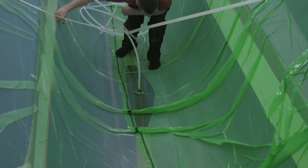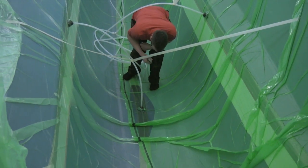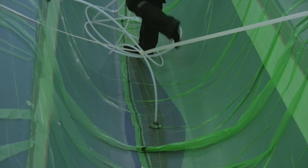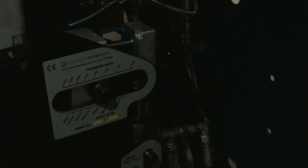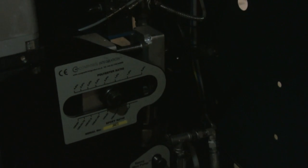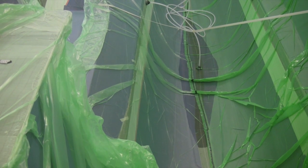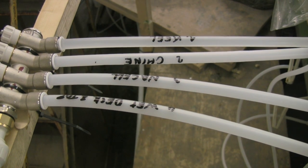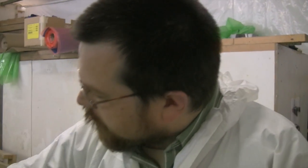Looking good down there — it's going to flow down the keel. Got about a metre and a half on this side of the length. It's flowing quite nicely actually. We've spent a lot of time this morning checking vacuum levels, drop testing the vacuum, making sure that the ratios of resin and hardener on the machine are coming out right. The resin is now flowing in through a series of manifolds, pumped in through the inlet, starting in the keel and working up through a parallel system. As we reach the next set of inlets we'll turn the inlet off at the keel line.